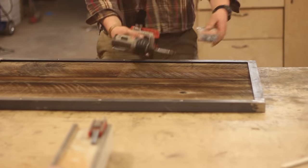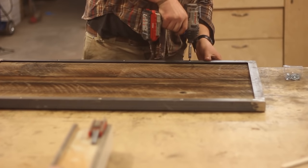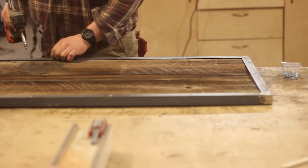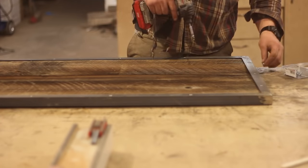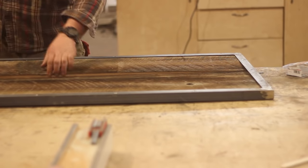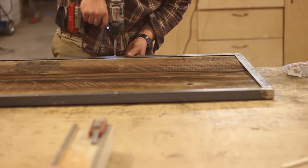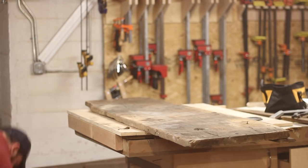This part's pretty self-explanatory - I'm just using three-quarter inch wood screws to mount the wood into the frame itself. It's a really simple easy way to build a frame and mount some wood into it. Now because the back will be against the wall, if you wanted to you could throw some stretchers to make sure that piece is held together a little bit tighter, but for as small as this one is I didn't feel the need for that.